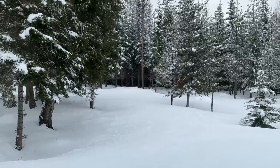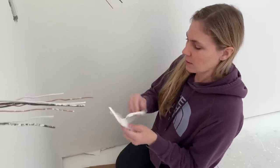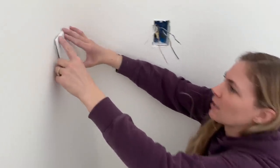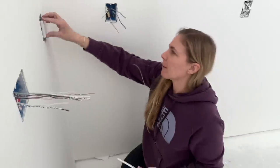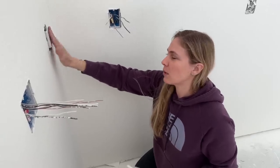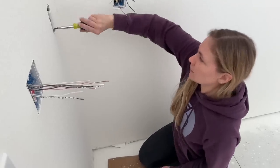There's nothing out there but snow. One of the problems I'm having is actually trying to get the outlet flush. When I take the plate and put it up here, sometimes it doesn't go flush — it's like not square, like it's twisted inside the box. I don't know the trick for that but I'm struggling with it. They're all looking good right now — it just takes a little extra effort to get them straight.